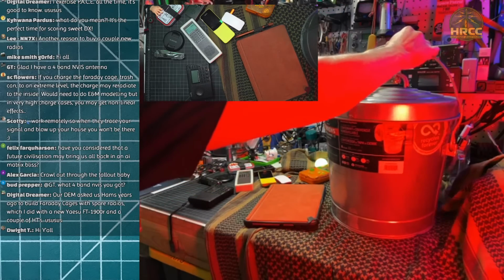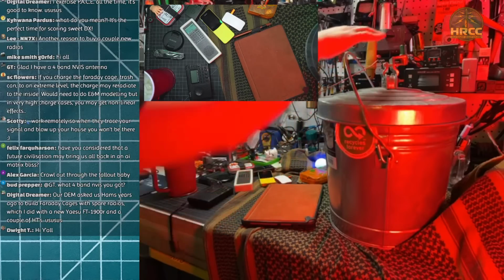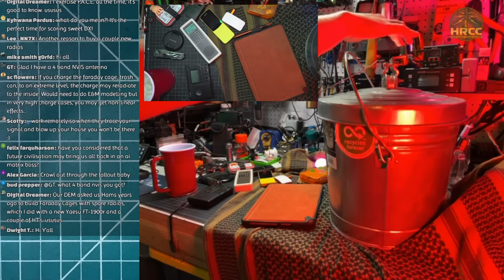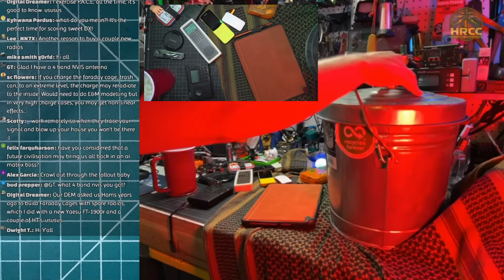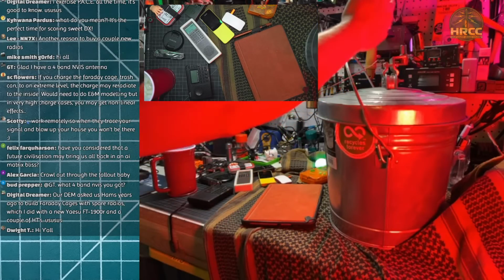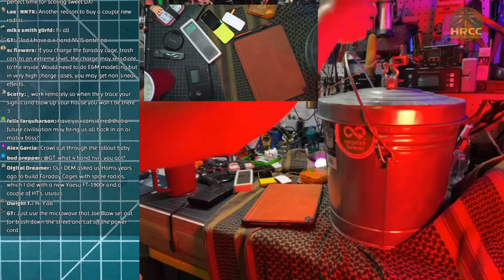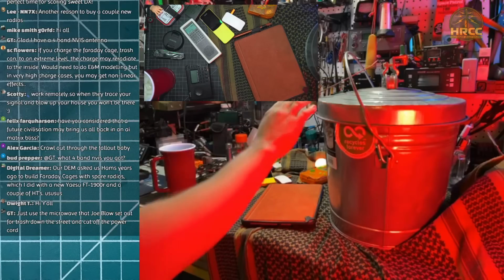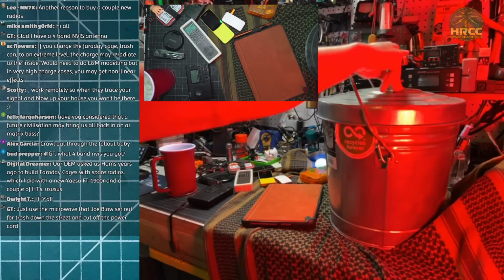This is actually, if we turn this a little bit, a quarter 20 mount for a ham stick, or in my case, there is a screwdriver antenna that you can put in there, and that works just fine. So this is a nice little steady mount, particularly if you have some weight in here, which you probably will. You won't necessarily just drag everything out, dump it all on the floor, and go, okay, it's time to set up comms. Probably not. You're only going to grab like an HT or maybe a shortwave radio out of here. And you've got multiple mount points for radials. You can mount directly to the strap, the can, whatever you want to do, and it'll count. So that's there. And when I did the test, I actually had a screwdriver mount directly on this.